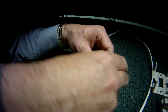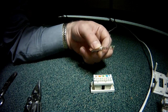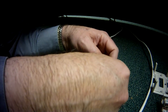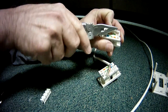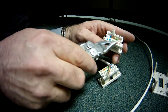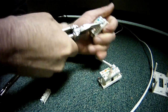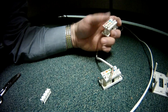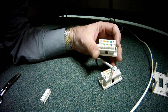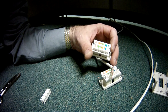What I've done already is stripped off about an inch and a quarter of the jacket and I'm fanning the wires out. You can do this pretty easily because most jacks already have a color code stenciled on them. They usually have two color codes stamped on them — one is called TIA 568A and one is called TIA 568B, or just T568A and B for short — two different wiring methods.